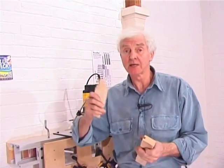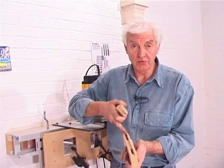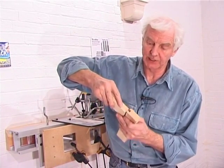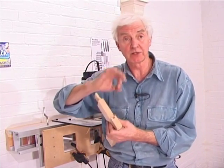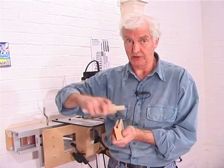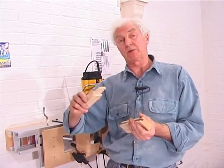That puts the tenon, which was made the same width as the bit, which is the same thickness as the groove, dead in line to drop into the mortise. And not by chance, the haunch on the tenon now fits into the groove to the right depth. And you can either square the mortises to fit the tenons, or leave them rounded so that you can take the whole thing apart, gives a little room for that. Or even you can round off the tenons, which is sometimes useful.